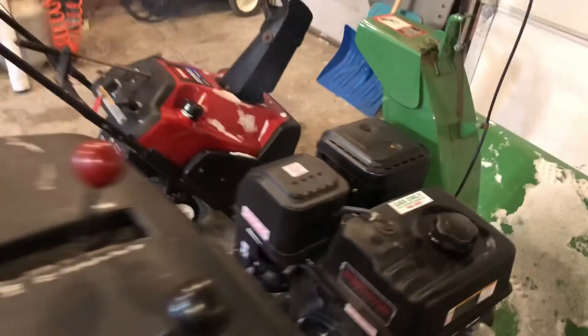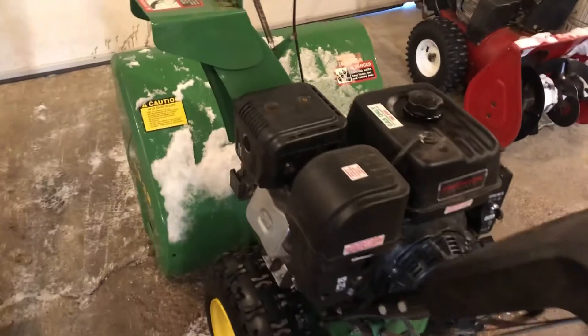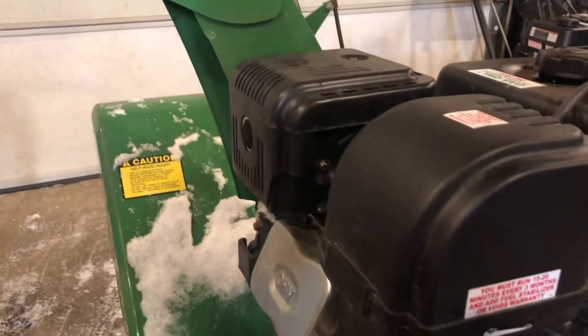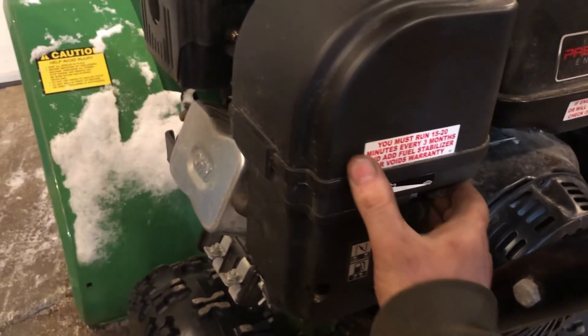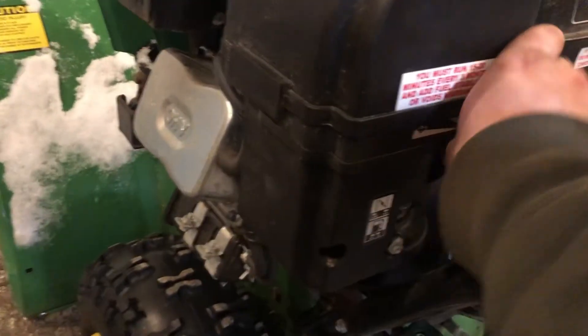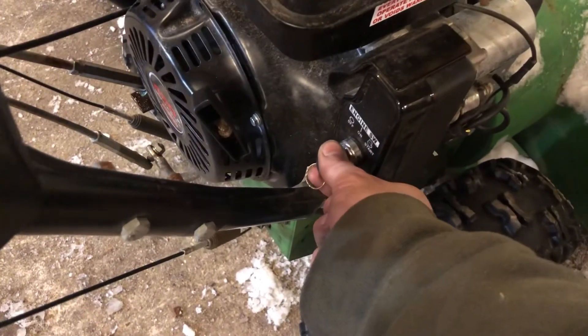Okay, we just started the engine, and it already sounds like it's up to temp. It sounds like it's running rich — the engine is a little labored, the smoke is a little cloudy — so we're going to back off the choke and bring our throttle up to full operating speed. Now we would be ready to do our walk with the blower. When you're done, back your throttle down about halfway and let the engine idle for a moment. After that, turn off the key.